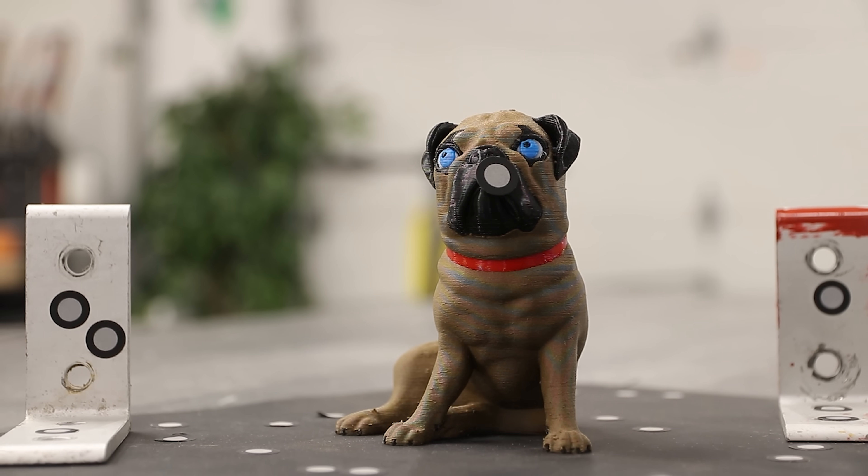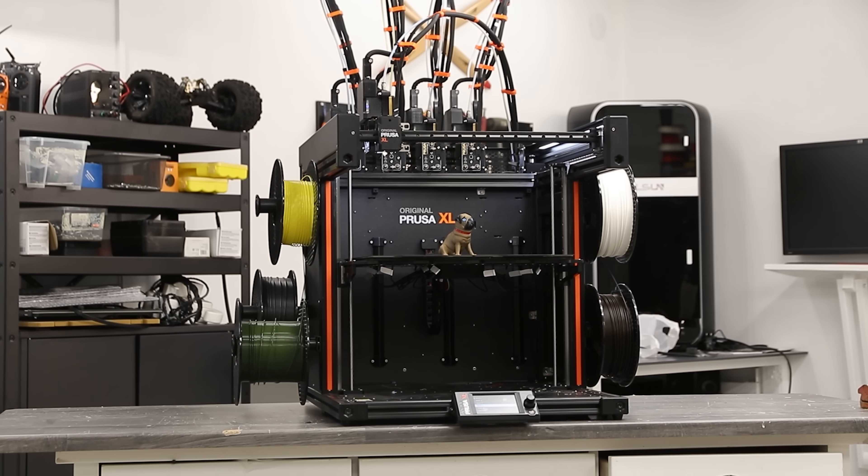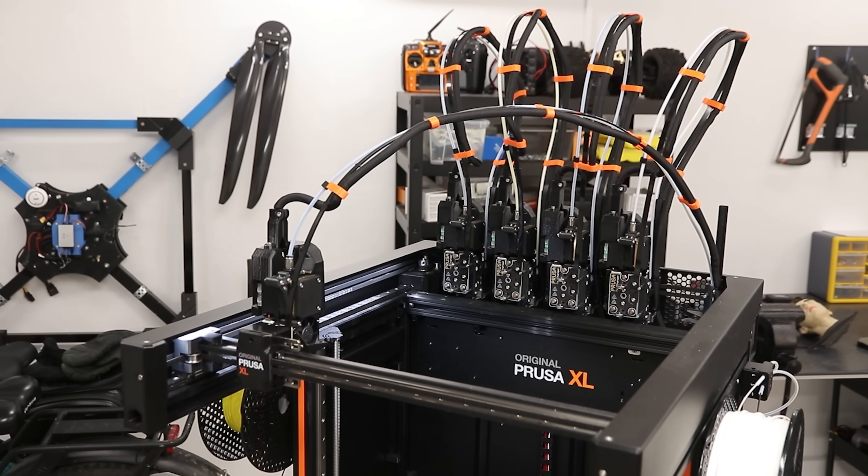It's interesting because there were items where the blue laser just said no — it won't scan them whatsoever. It could be too shiny or even too dark, so the blue laser light doesn't scatter back to the sensor. You also have to add all these markers to everything, which can be a little annoying. But there is a way to skip all of this: use the infrared mode, marker free. I found it way easier to work with, so that's what I ended up using most of the time.